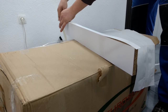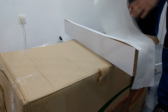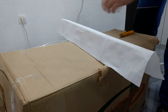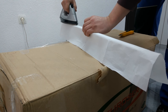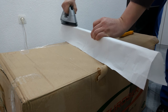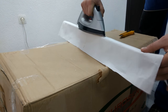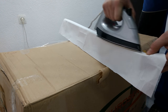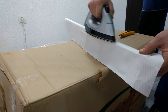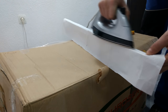For any piece that will not have a lot of day-to-day usage, applying it at home is good enough. First cut a piece that is slightly longer than the edge that you want to cover and place it on top of it. I was placing a paper towel on top to protect the plastic a bit from the old iron head, but if the bottom of your iron is clean then you can skip this. The trick is to apply the heat evenly along the entire length of the edge with some pressure, so the glue that is pre-applied on the edge banding can melt and penetrate the open edge of the melamine.